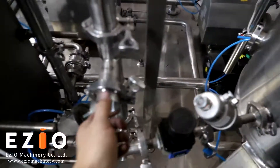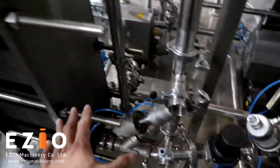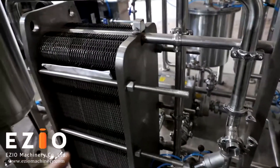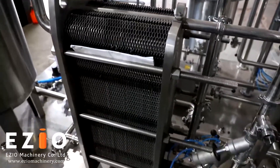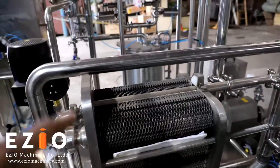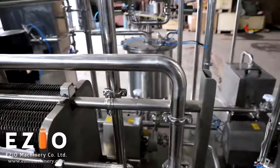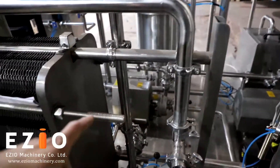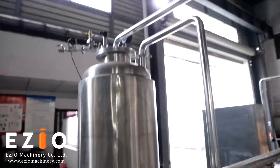You need to connect cold water from here to make sure the heat exchanger is cold enough. The heat exchanger will bring the temperature of the mixed product down to approximately minus 3 degrees — very cold — before it goes to the carbonation tank.